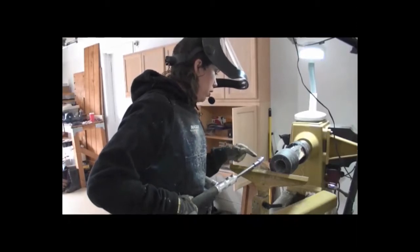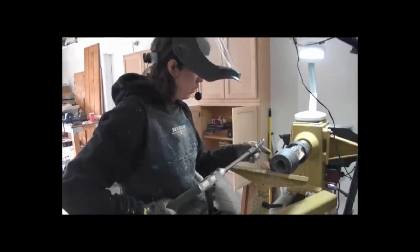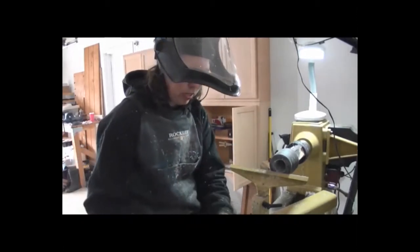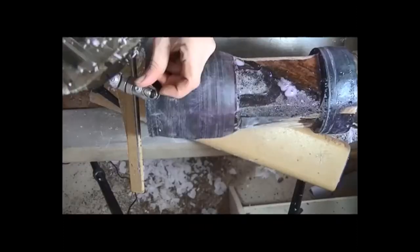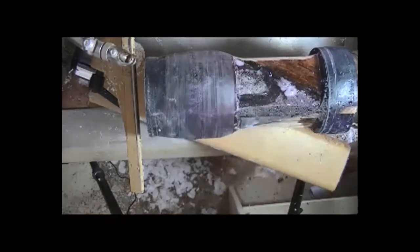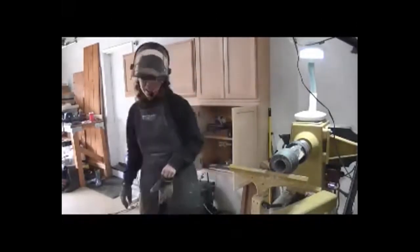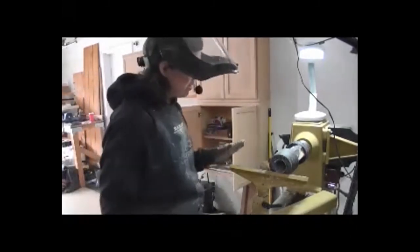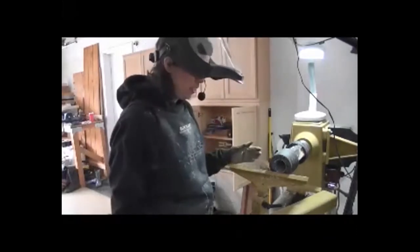But you have to hold this tool perpendicular at the bottom, and then when you're coming out on the side, this little angle here, you have to make sure that you absolutely hit your piece right there and nowhere else. Otherwise, you get a catch that's just constant. And it feels, I don't know if I'm the only one or anything, but it feels scary. It makes you jump. But I was persistent, I continued, and I know how to use it. It is an excellent tool.